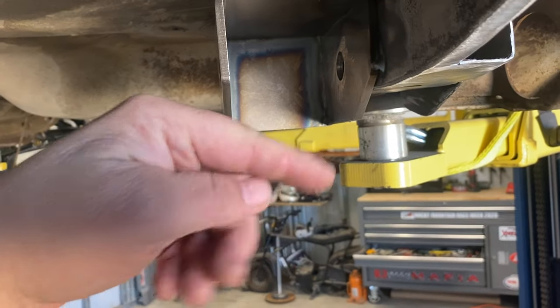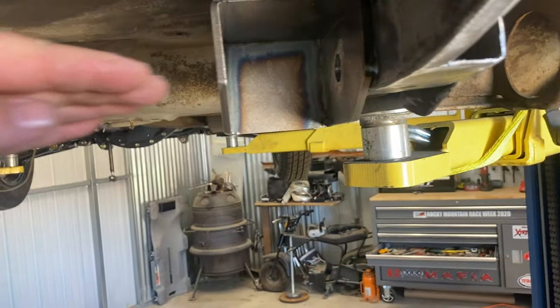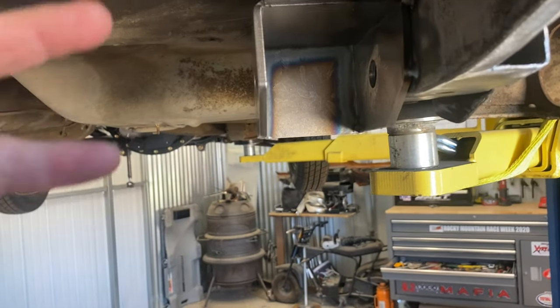I think I said earlier that it seemed like the spring was twisted because when the bolt was going through the box, it wasn't correct. It wasn't level, and the box wasn't level. I didn't have the right bolts. The Funkhouser kit came with 9/16 holes for 9/16 bolts, and I think I was mocking this up with 1/2 inch, so there was a lot of wiggle room even when it was tight. I've eliminated all that now with getting the right bolts, and I'll have these things all tacked in level and right and square, and that should make getting the back done a lot easier.